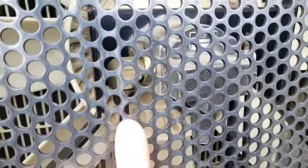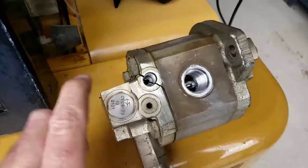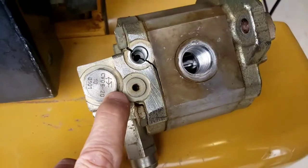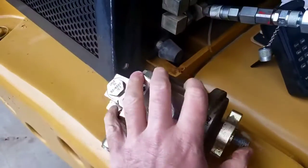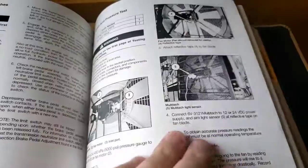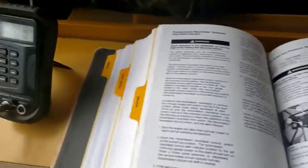If you're the type that believes everything you read, you would plug off that fitting and force the relief valve to open because the oil couldn't turn the fan motor. When our tech did that a couple of years ago, they found out that return line can't handle the flow. As you start the engine, the fan motor housing splits in two. I knew to question that process right off the bat, but I can't fault someone for following a Caterpillar service manual word for word. They wrote this procedure obviously without proving it.